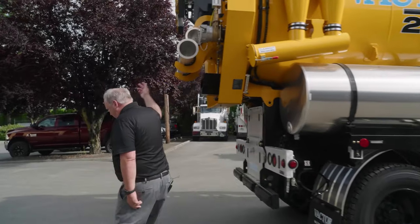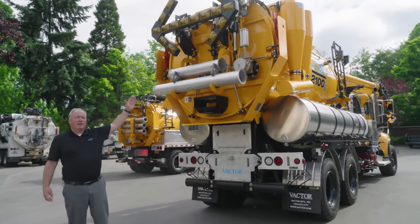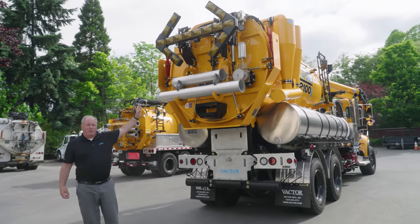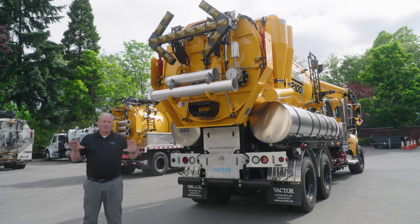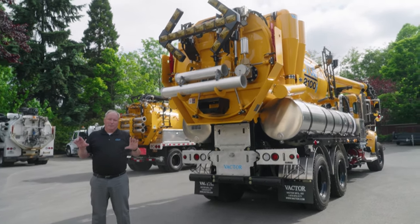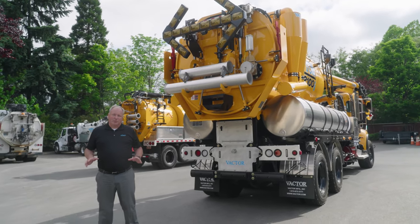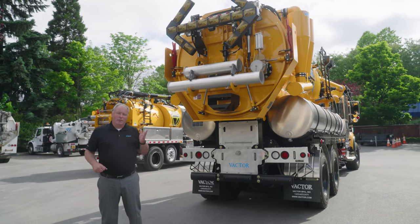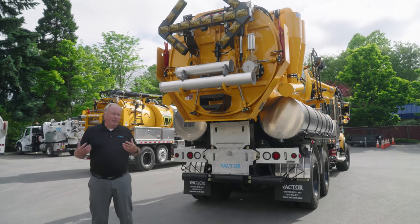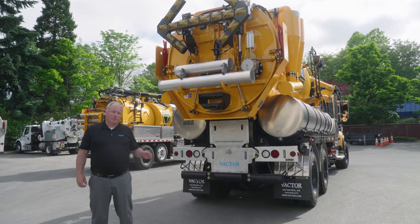On the back of this door here I want to show you — the truck has a design that's been around since 2010 with the Plus. It has two cylinders and a latching mechanism in the middle that pushes pins out like a bank vault, locks it tight. It's a simple design — just push to close and open easily without having to do any latches or other configurations. One button push to open, one button push to close.